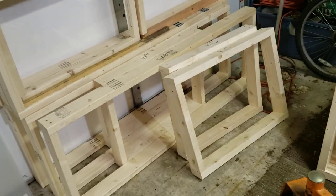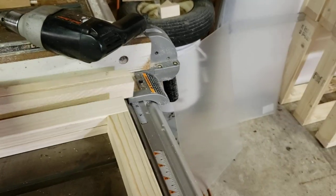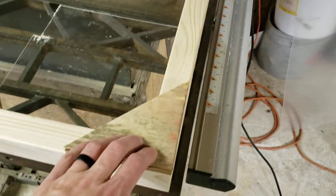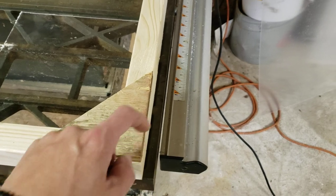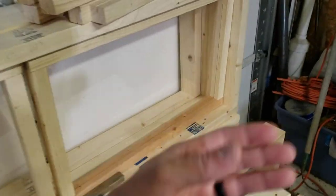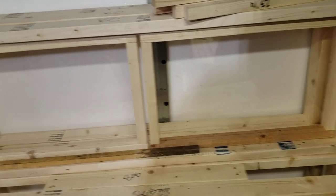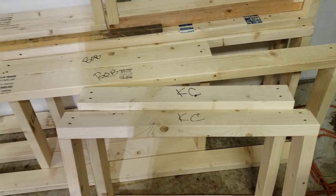That's not enough, because it's just a 2x2 or so with a groove down the middle. I have about five-eighths of a cut to give it a decent amount. My plan is to come back through and take a piece of OSB or plywood and beef up all the corners — I'll just take my air stapler and staple it in to beef those corners up. For the big windows I'm doing two panels as opposed to one, and you'll be able to individually open and close them. With the smaller windows — like some of these are for the doors — I'll just have one window that can flip up or down.